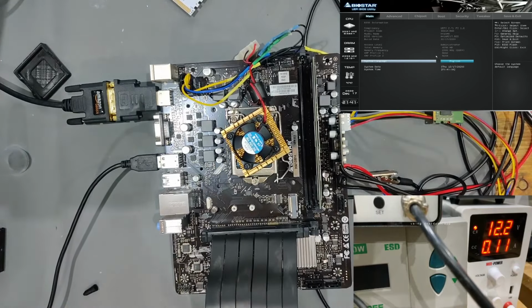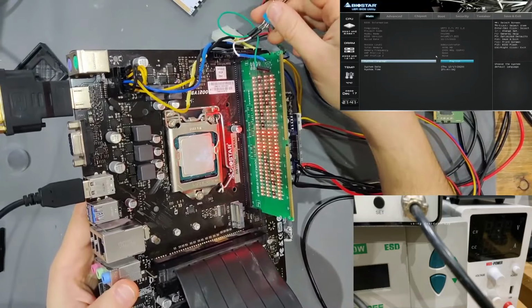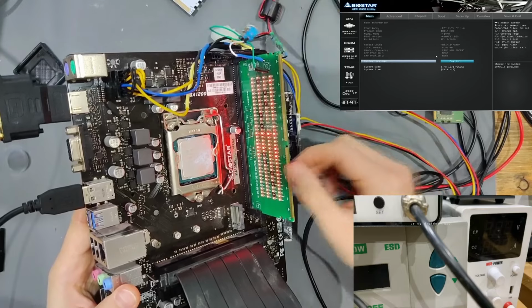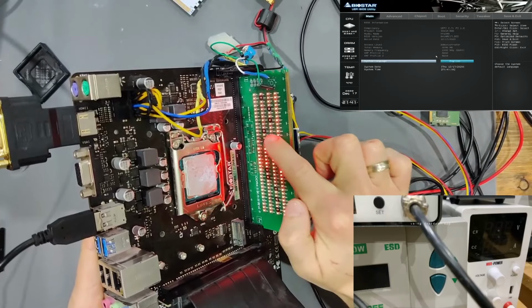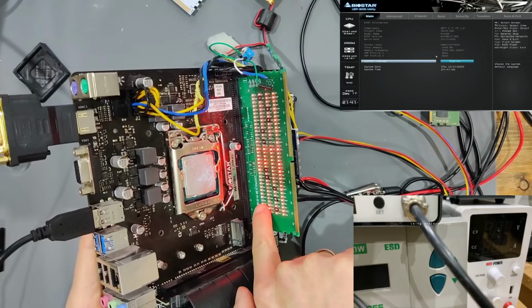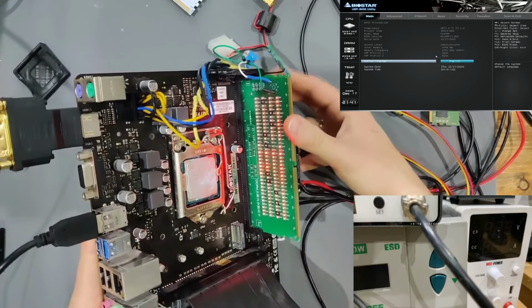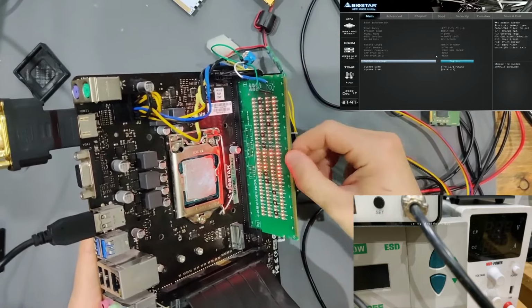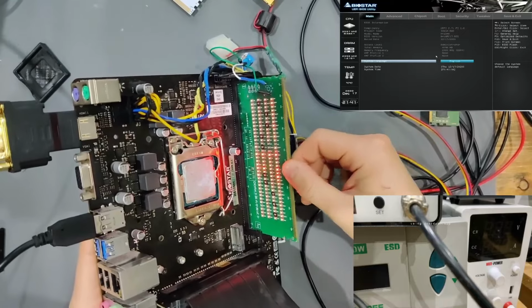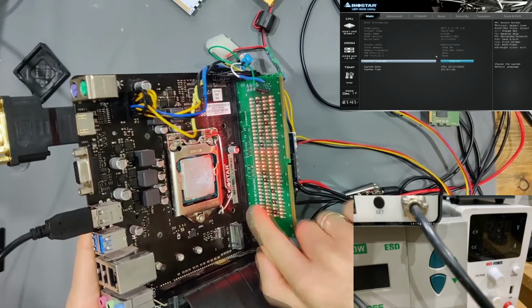Let's get our DDR tester into here, and let's see what kind of signals are missing. And right now, let's see together if there's any LED that is missing. And yes, I can see a single LED that is missing. These in the middle I don't think are supposed to be on, but there's a single LED down there that is not on. And a good test is to wiggle it around and see if there's any change in that. But as far as it seems, that contact is completely broken. So we will have to find out why that isn't connected anymore.